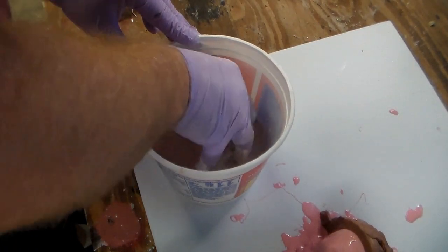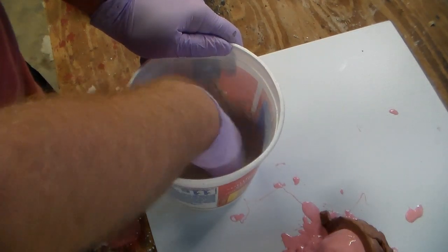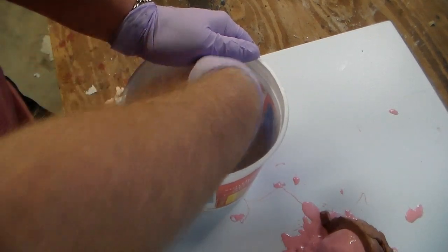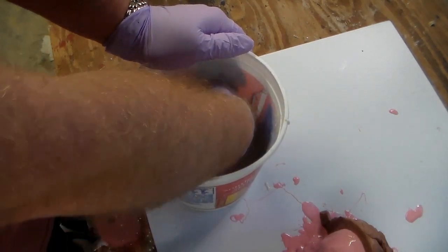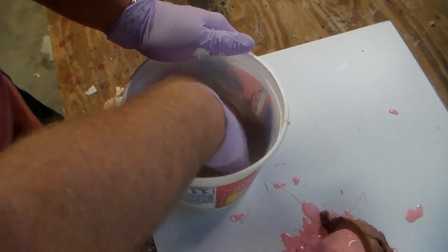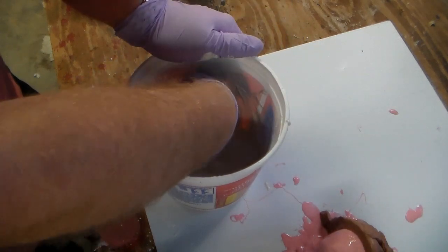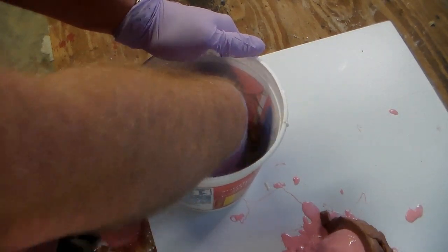It's best to mix this stuff up with your hand so you can squeeze out any lumps. Always wear gloves while you're doing this — be careful with plaster cleanup. Do not put it down the drain of your pipes because this stuff mixes with water and pretty much turns into concrete, and it'll turn your pipes into concrete as well. If you're working with large batches and making a lot of plaster dust in the air, wear a dust mask or respirator because it's going to form a little rock inside your lungs. Definitely wear gloves if you have wedding rings because this stuff will get underneath and dry inside the ring — ask me how I know.